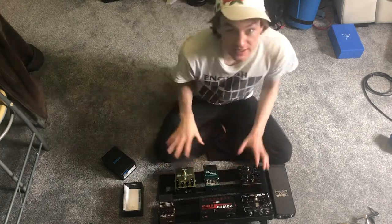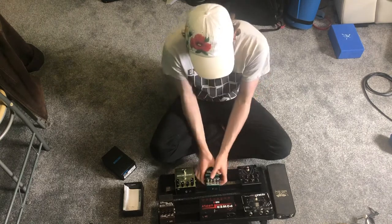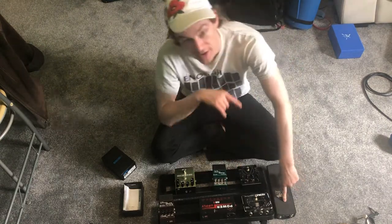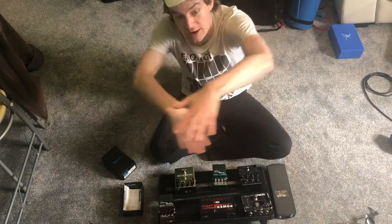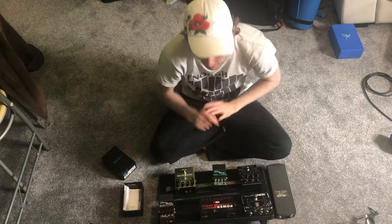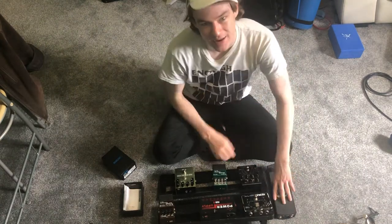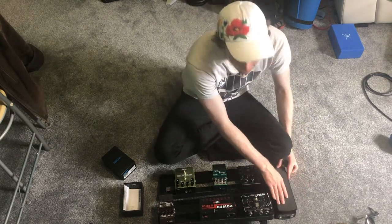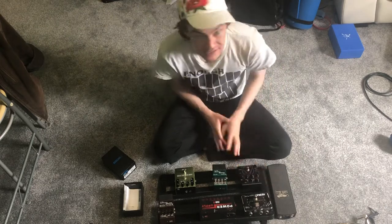It helps to sit and lay stuff out on the board like this because you have realizations like, I want the distortion after my volume pedal. So we're getting quite a nice constant signal because we're coming from the compressor. Stuff is relatively even all the way along, which means as we go into the volume pedal, max is going to be relatively always the same and min is going to be zero. And so we can decide how hard to hit this lad with all its non-linearities and drive.